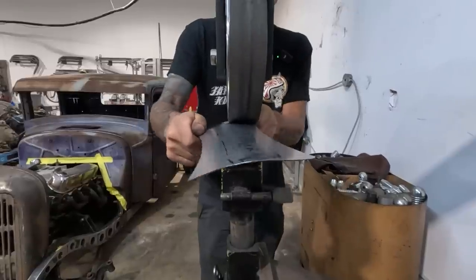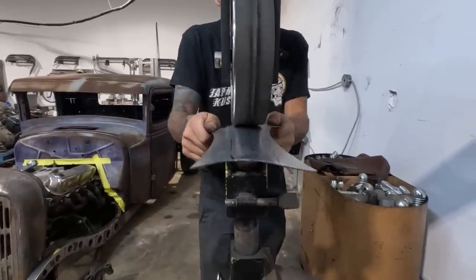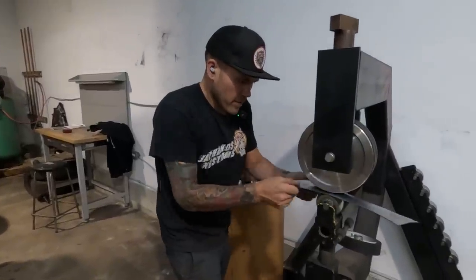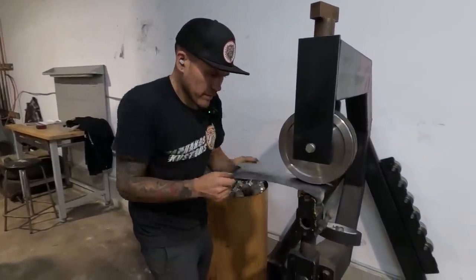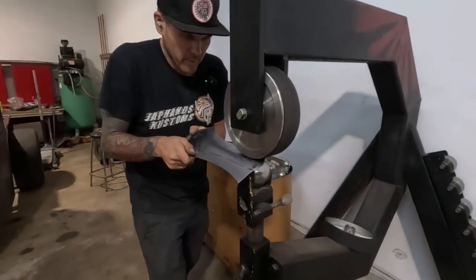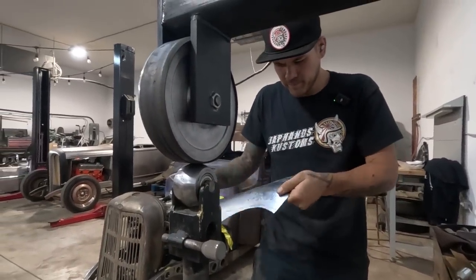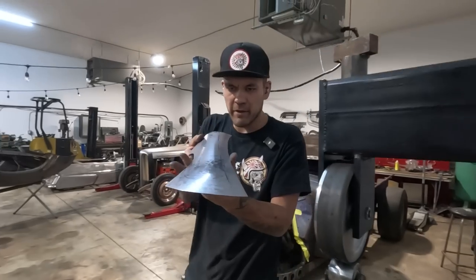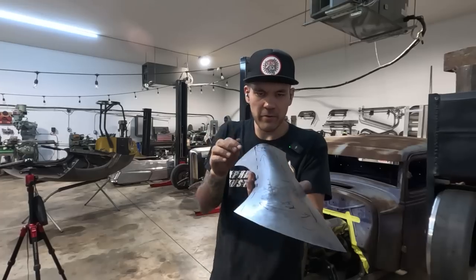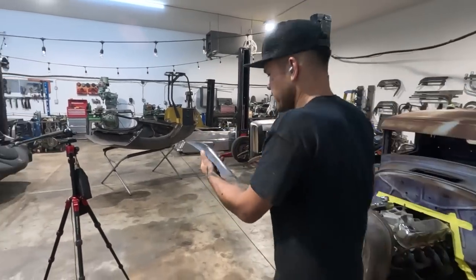Right now I'm kind of just adding form. This isn't really changing the shape, as in it's not adding a shrink or a stretch. It is just forming the roll profile, I suppose, of the pillar. Okay, now you can kind of see what shape we're developing. We've got this happening in all directions, and then just a bit of a form here. We're still going to have to stretch a little bit on this side.